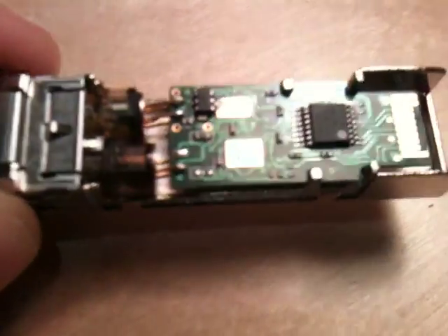Ladies and gentlemen, I've got two optical fibre transceivers here to have a look at. This one here is one of my Intel 850nm ones, and I'm not taking it apart completely because I do actually still want to use it. This one here is an 850nm short range 4 gigabit transceiver, which I'm using for gigabit ethernet purposes. It uses a multimode fibre, so the optical fibre core is 62 or 50 micrometres depending on the type of optical fibre.